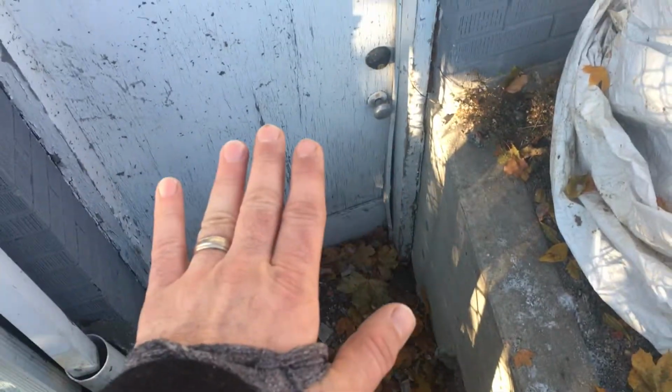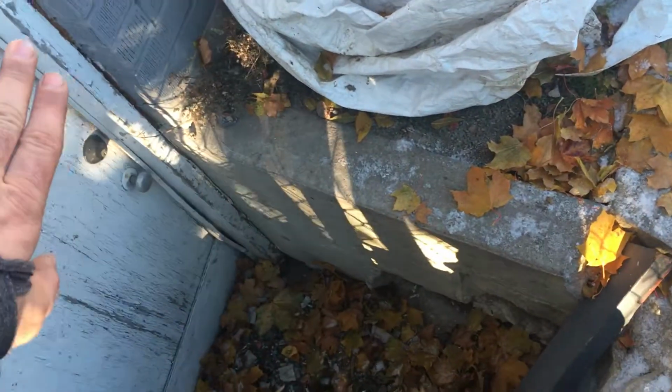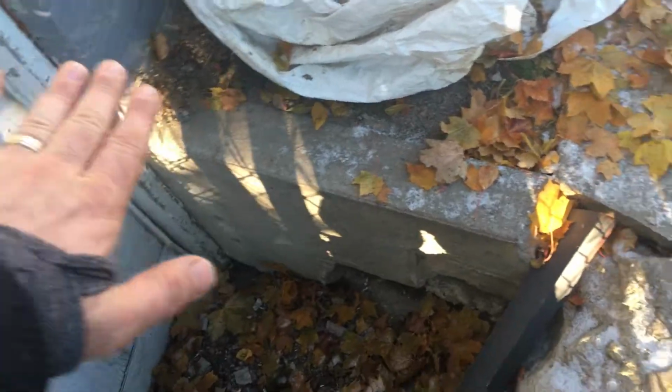And what you would have is essentially a big concrete pad over here that would have a downward slope away from the wall, and the front of the pad would land on this concrete. So as water landed on it, it would have a tendency to run this way, drop off onto this concrete, and keep on running away from the house and not work its way back in there. And if any residual water did, we've got crushed gravel, which would help it percolate down and find the earth this way, find the earth that way, but less likely to find its way back into here because we've poured concrete past the concrete here and past the concrete here.